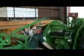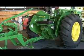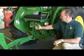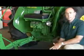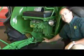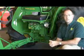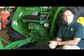Of course, the drawbar, which is what you're pulling. Let me go around front side. Some of the different hookups that were used on tractors over the years. Of course, we have the drawbar, which a lot of your towed equipment gets hooked up to. In this case, there's couplers back here for the hydraulic hoses. This tractor has that option. Again, to lift implements, plows, discs, cultivators, apparatuses like that, corn pickers. This tractor has the optional power takeoff, which is located right there. There would have been a shaft that would have connected it to a piece of equipment. Again, whether it be a corn picker, whether it be a manure spreader, sickle mower, rotary mower, something on that line that required power from the engine in a rotary fashion to do whatever application it was designed for.